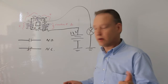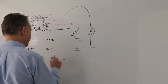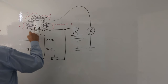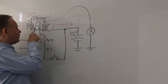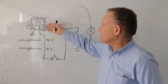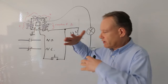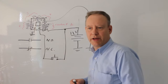With that thought, let's actually activate the coil. I'm going to put a normally open push button here and run it to the coil. I've got 12 volts going up to my coil, and I'm going to ground my coil. When I press this button, current goes into the coil, it activates the electromagnet, and it changes the contacts — switching the connection between the common and the normally open. It makes them connect.